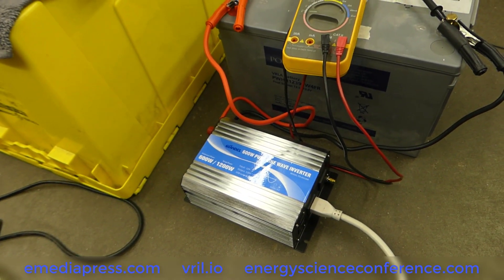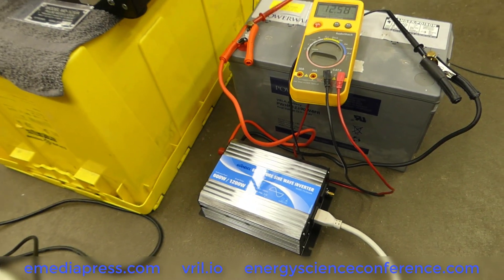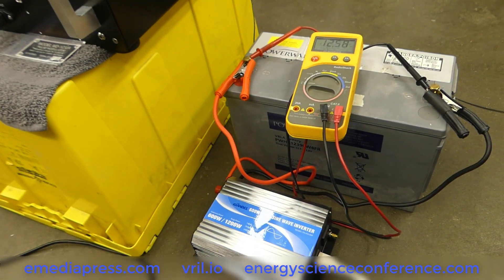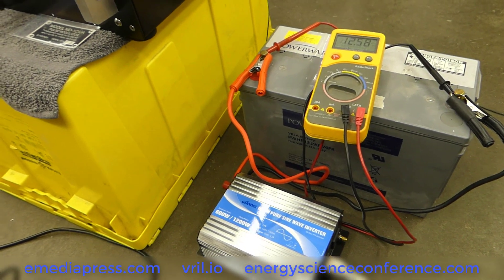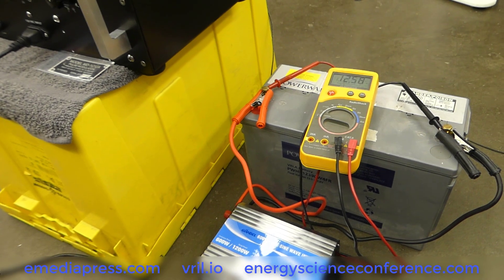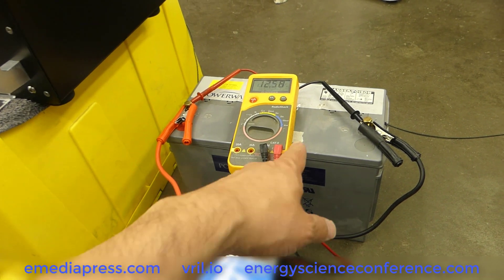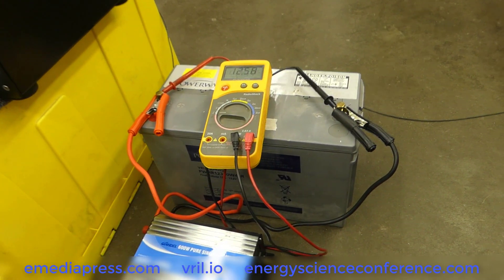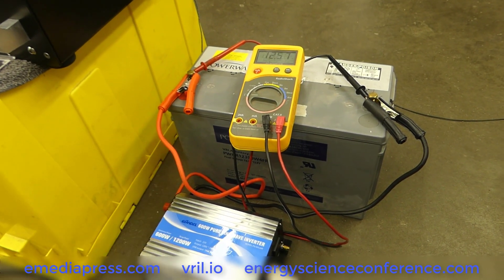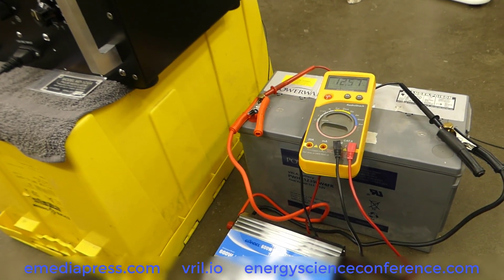I would recommend maybe about a 100 to 125 amp hour range battery. At full power, this is actually going to exceed the 5 hour rating by just a little bit, but you're only running it for about 15 minutes so it's not even going to really touch the battery. Also, if you have a 220 volt 50 cycle power supply with a DC output, that could be connected to the inverter to run it as well — a lot simpler and more elegant solution than completely redesigning the inside with different components for overseas.